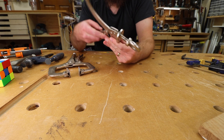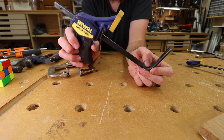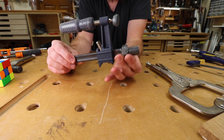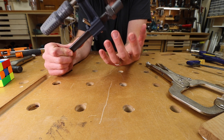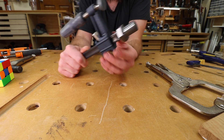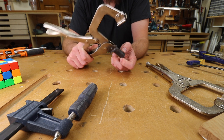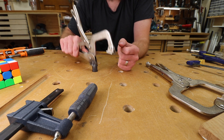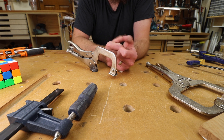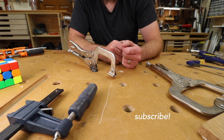In summary: the drill press clamp is going back by the drill press — I won't use that again over here. The quick clamp is a great clamp if you don't have a welder and want to use stuff you have on hand. But the Harbor Freight bar clamp with a bolt welded on is arguably the ideal multi-tasker clamp for the MF slab — at least the ideal hacked-up multi-tasker. I love these. I have four made up, and my next step is to make three more of the drill press style, because they're great for repeat clamps on the same thickness material, which I do fairly frequently. Stay tuned for the MF slab dogs video coming up soon.